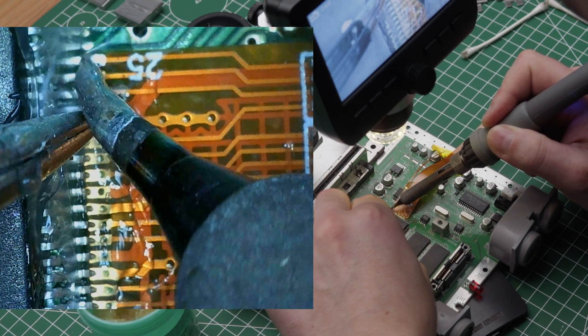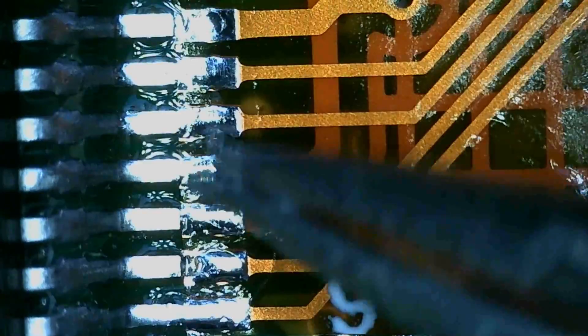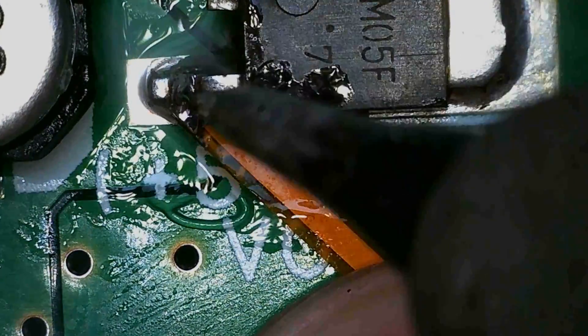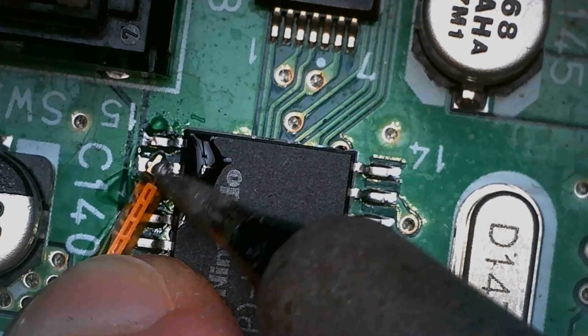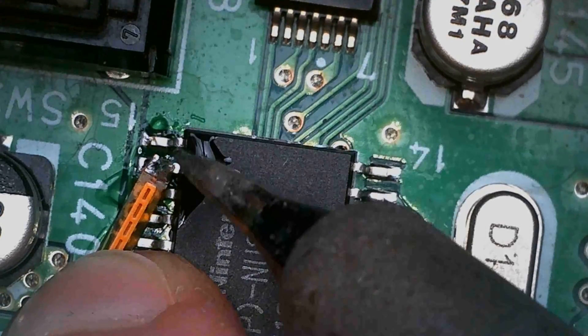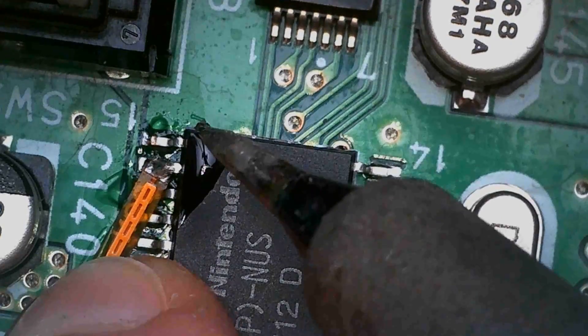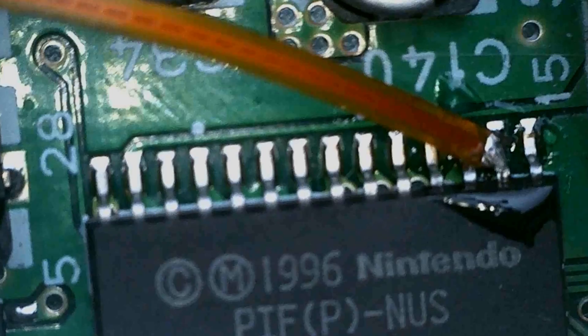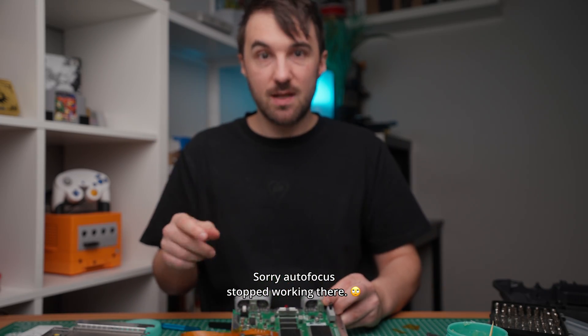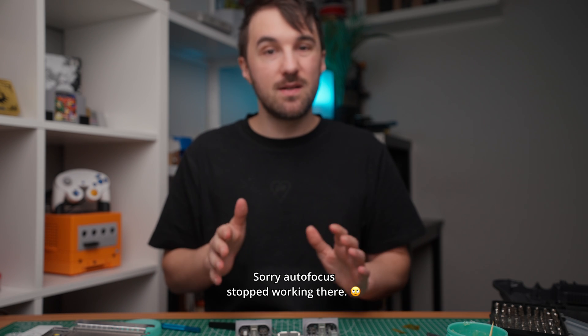To verify a good connection, I use a pair of tweezers to check if the joint is good. You could also use a multimeter to check for shorts. After that we need to solder this part of the ribbon cable to the connector labeled 5 volts. The other one goes to the second leg from the bottom right of the PIF chip, which stands for Peripheral Interface Bus. This enables us to access the menu of the HDMI mod with our controller later. With that, soldering is done for now.